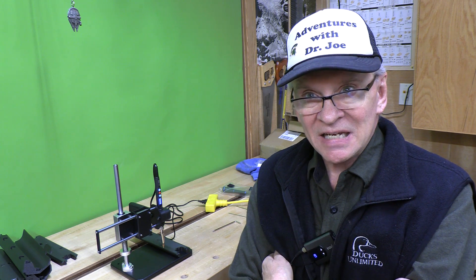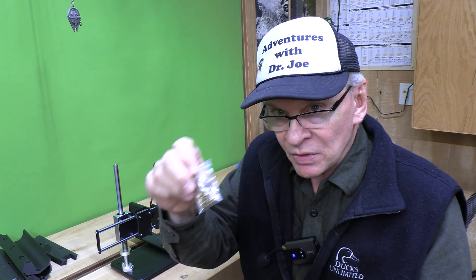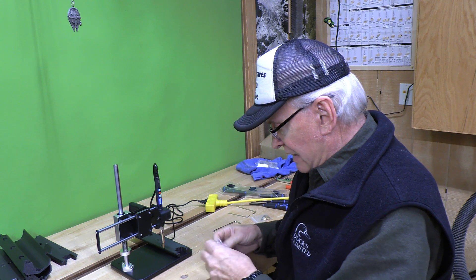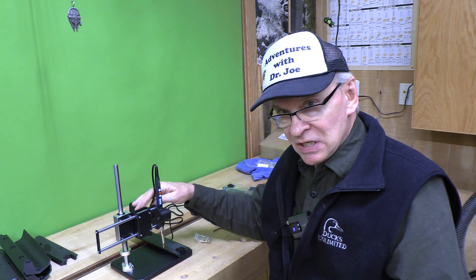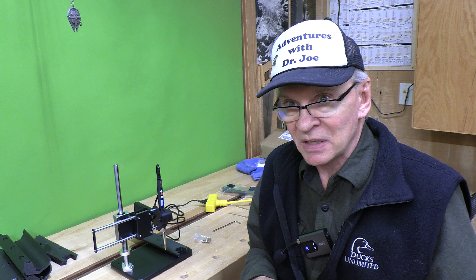One thing that helps put these pieces together for assembly are these threaded brass heat inserts. They come in all sizes. These are the three millimeter ones, which are used for this project — a filament enclosure. There are many ways to put these in: you can use a soldering iron, or another type of insert tool with various tips, but a machine like this allows you to have these threaded inserts placed perfectly perpendicular, which is what I'd recommend. Let's put one in.